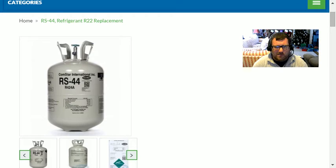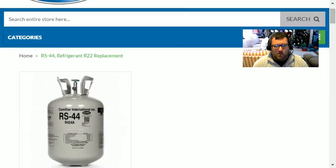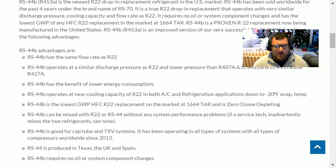Some refrigerants are now actually mixing oil in with the refrigerant. I think R-421A is doing that — originally when I looked at the composition of 421A it didn't have any hydrocarbon, so I was wondering how they could advertise it for R-22. I think it's actually using a mixture of oil in the refrigerant, like that 407C that Ralph mentioned, where a particular brand integrates oil into the container.